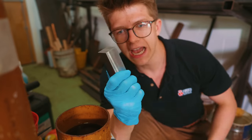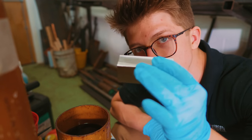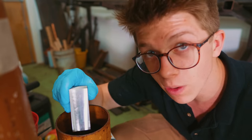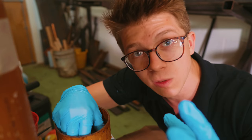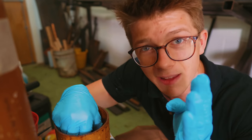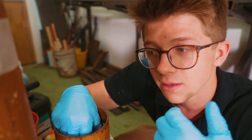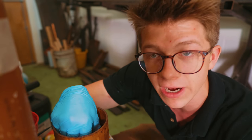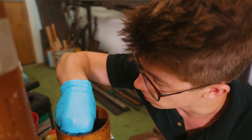It's off the mill. We have ourselves a nice square block. Now, the main thing wasn't getting it square. The most important thing was getting through all the TIG welds. Even though a lot of them were fusion TIG welds, that does affect the pattern. A pattern relies solely on there being a differentiation and a boundary between one alloy and the other. As soon as we make a puddle, there's no differentiation. It is just this conglomeration, this alloyed bit, instead of two separate alloys. So we've got to get through all the weld, and that's the key thing, because now we are etching it.